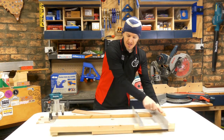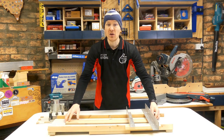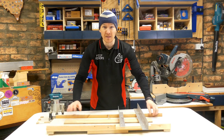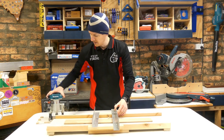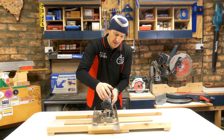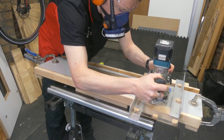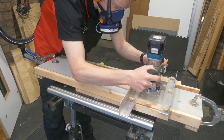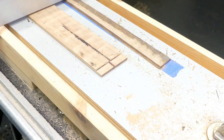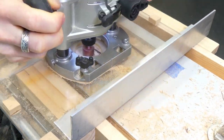It's not complicated. The sled can slide that way. I usually use double-sided tape, or if it's long enough you can clamp it down at the end. If I wanted to flatten this out and make the sides parallel, I put my surfacing bit on my router, plunge it down to an appropriate depth to take off a little bit, and you can slide the whole assembly. This can take things down pretty darn thin — you can get to a couple of millimeters, maybe an eighth of an inch, three mil, with a setup such as this.